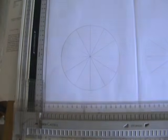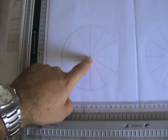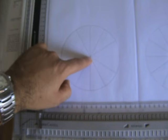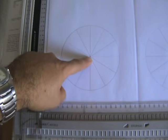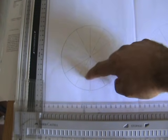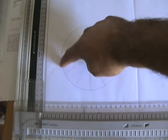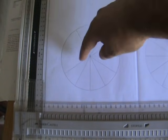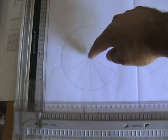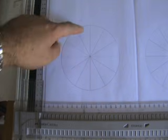This lesson is about the Archimedean spiral. The Archimedean spiral starts at the center and finishes at the outer diameter — in this case 130 millimeters, with no inner diameter. I'm going to do a clockwise spiral starting from this line. The Archimedean spiral is a point that travels one revolution as it covers that distance. I'll divide the distance into 12 equal parts, and I've already divided the circle into 12 equal parts.